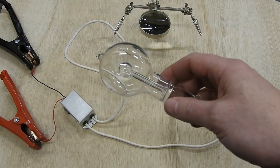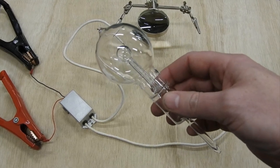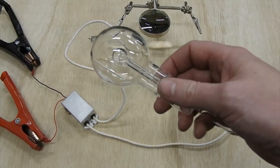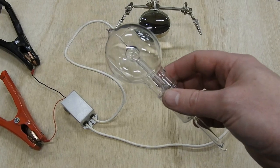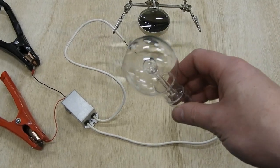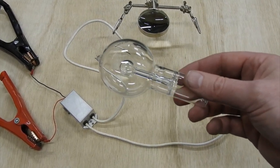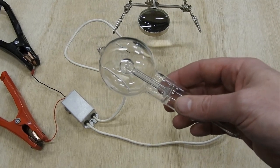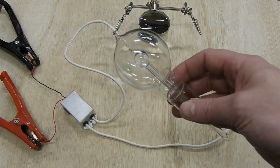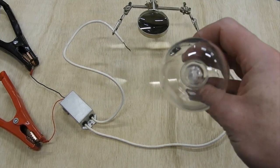To about 25% atmosphere. So with, let's say, 100% being full vacuum, this is about 25%, which is the fill pressure that's used for neons. So it was just a starting point for the English glass blower. The US glass blower, Dave Porter, did quite a different fill pressure, which was actually more like 93% vacuum still. So quite different fill pressures, and we still got some really, really interesting results.